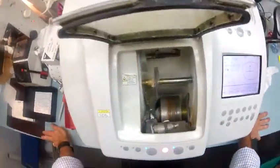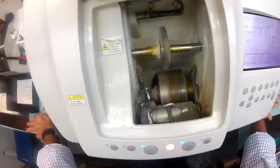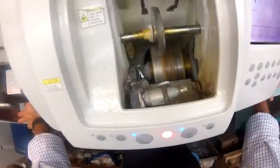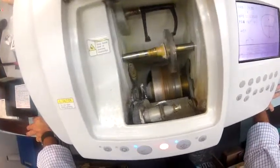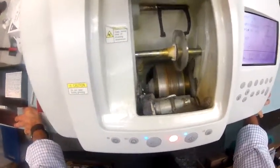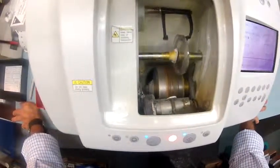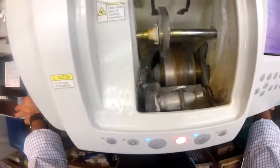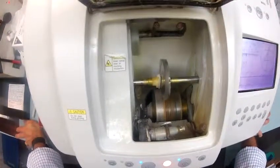Just like before, the calipers are going to come down and trace the concave, the rear surface, the back surface closest to your eyelashes. Then it's going to move over and trace the convex side of the lens, which sits away from your face. That will conclude your vocabulary lesson of the day. Round and round. Camera one. Camera two. Camera one. Camera two. And once this begins cutting, I'm going to go ahead and continue to work on your right lens.